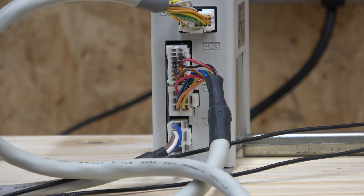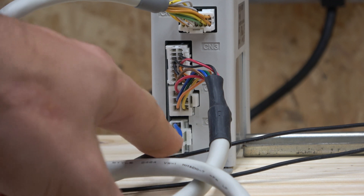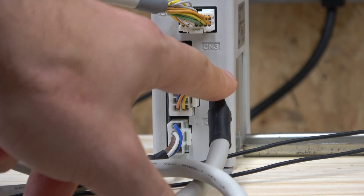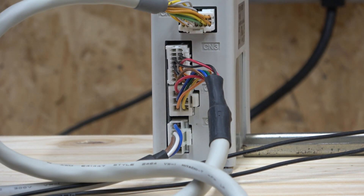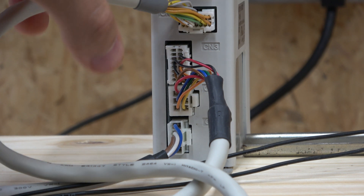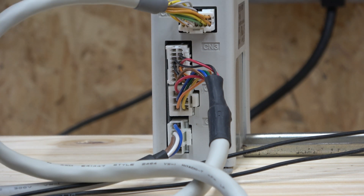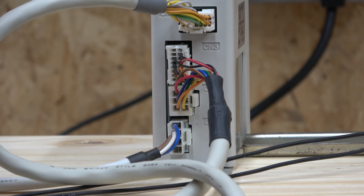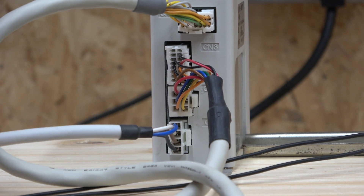Right from the start you will need three different cables: CN1, which is the power cable; CN2, which is the cable that goes to the motor and encoder; and CN3, which is going to be working the I/Os - pretty much inputs and outputs. I'll quickly run you through the power supply wiring now because at the beginning it looks a bit confusing - it's got four different cables.